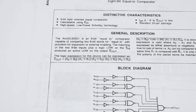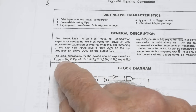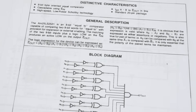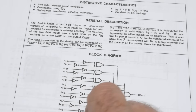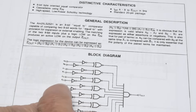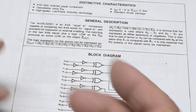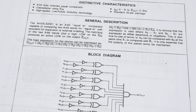And here's the formula. I did a video on how you read these Boolean things, but it's A0 exclusive NOR with B0. It's this weird thing. What it does is it takes this A and this B, compares the two. This A and this B, compares those two. This A and this B, right? And it goes through all of those and then it adds them all together to make sure everything's a match. Everything has to be equal — if one thing is off, it's going to be wrong. And then it gives an output.